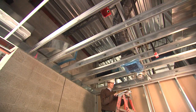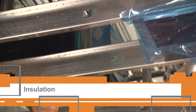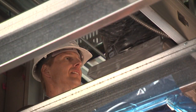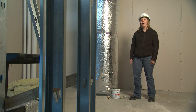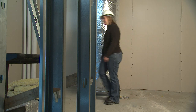Check the code to verify the insulation level for your climate zone. The level will vary based on climate zone and location of the ducts. The code also requires that the insulation R-value be printed on the duct insulation every 3 feet. It should be easy to compare the installed duct insulation R-value with what is shown on the plans. A properly sealed duct system with the correct insulation will help increase the comfort and lower the energy use of the building.